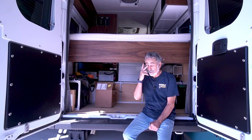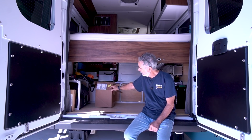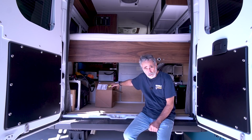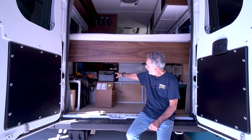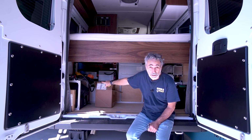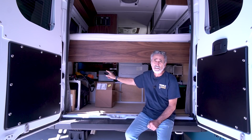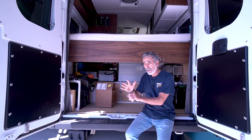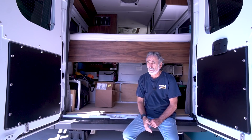He wants the second alternator on a ProMaster, so I ordered it from Nations. I got the whole kit: 280 amps while he's driving, 180 amps of charging at idle, and a Balmar voltage regulator. I knew this might be the case in the future, so I've already run the sense wire for the Balmar regulator. It's already up front. We just have to make the connection. It comes all the way back here to the BMS harness.